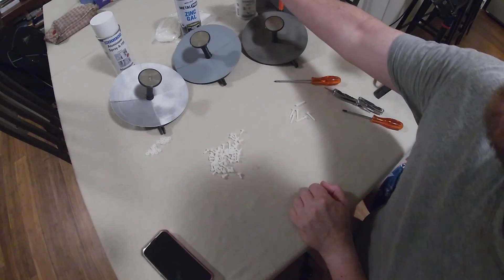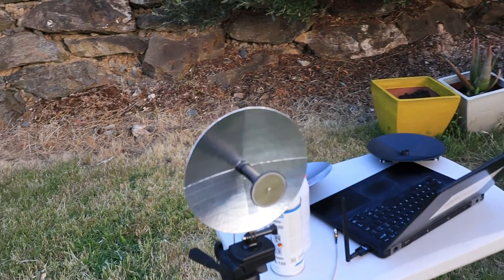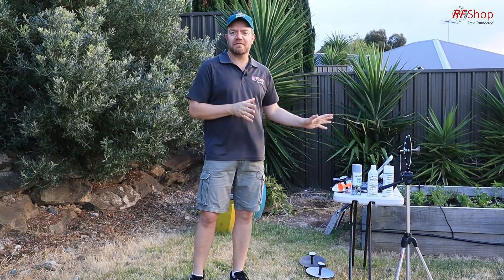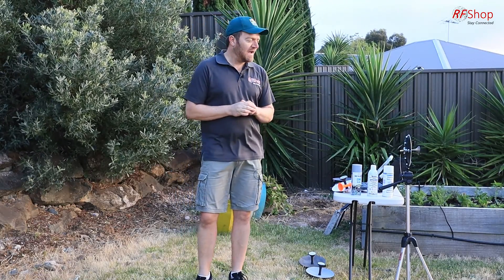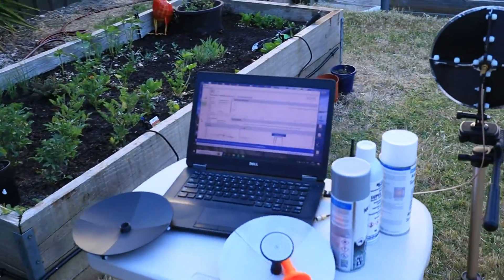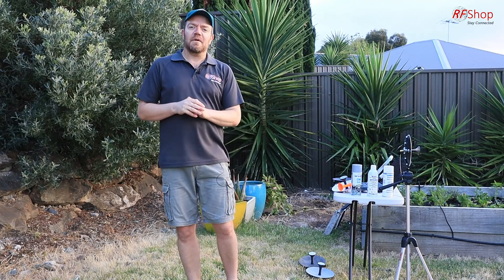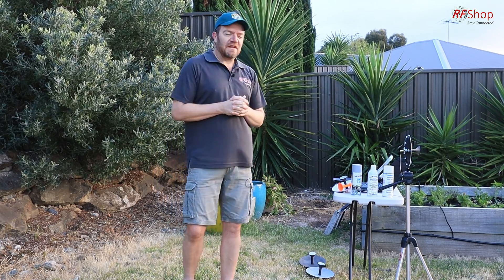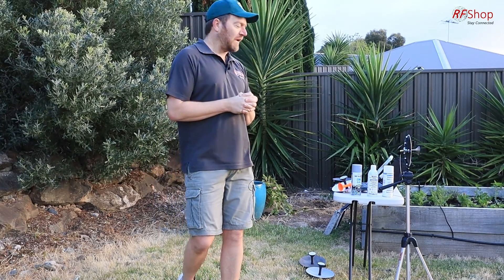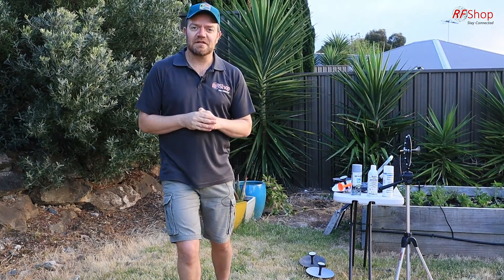You can see on the screen the four dishes — three of them sprayed and one already had the aluminium tape backing. The test setup is just to see that the metal works; it's not about performance yet. I've seen a lot of reflections. My dipole is not doing all that bad, and when I swap it over to the dish there'll be a difference, but it's not a massive difference today because I'm just pointing into the house and the Wi-Fi router is deep inside. I need a clear open point from A to B to get scientifically meaningful results. My biggest goal today is to prove to myself that the aluminium spray works and the nickel spray works, and for fun, whether the cold galvanized zinc spray works at all.